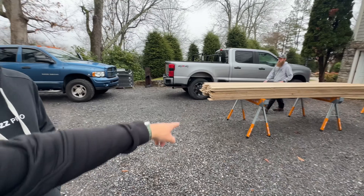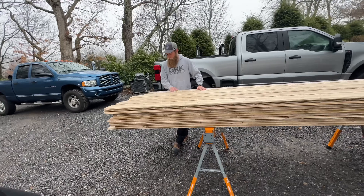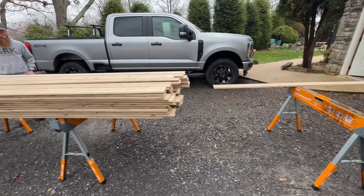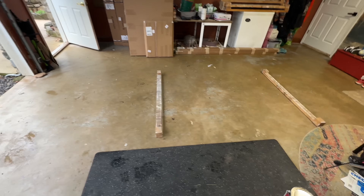We're all set up this morning for coat number two of our polyurethane on these ceiling boards. It's a water-based polyurethane satin. I would definitely prefer putting even three coats of this stuff on versus two coats of the oil base, because it dries so fast, it doesn't stink, you can clean your brushes easy — but it doesn't quite go on as thick. So I think we're going to do three coats. Jason thinks we're done already before we do the second coat — and he's not even kidding, he literally can't believe we're doing more. I want it to look really nice. This coat is going to include a light sand, then a wipe down with a rag, then we'll be at the poly station and down to the stack station — it's like an assembly line, a flow of material.